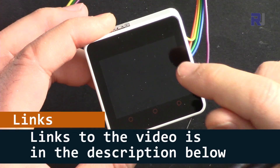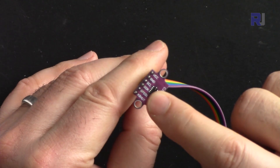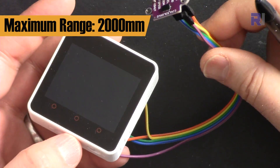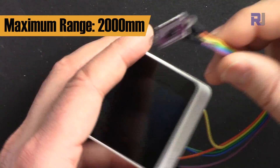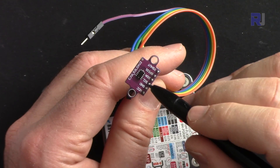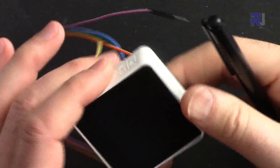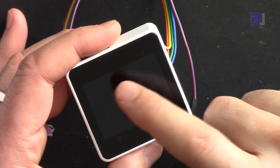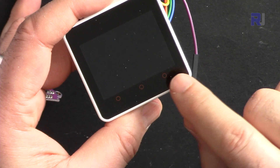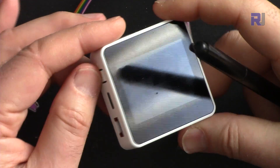There is a separate video fully explaining this module and the VL53L0X sensor - the links are in the description. The VL53L0X has VCC, ground, SCL, and SDA pins. SCL is the clock and SDA is the data pin. The feature implemented here allows measuring distance in centimeters or millimeters, selected with two touch buttons. The third button is used for power - touch it and the device shuts down in three seconds, then use the power switch to turn it back on.